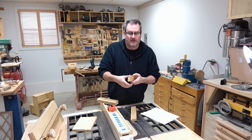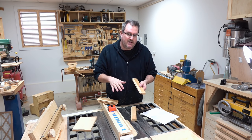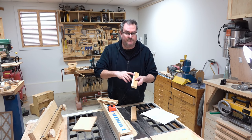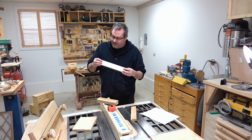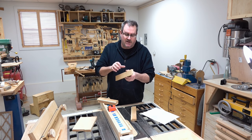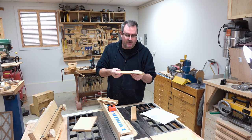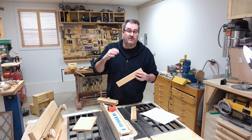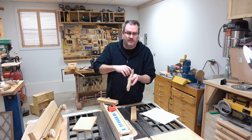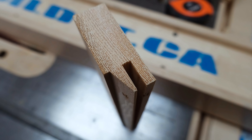As far as the profiling goes, these pieces are done — they just need to be sanded a little bit to make them smoother, although if your saw is set up right with very little runout and a sharp blade, you won't have much to sand. I should mention I couldn't get the quarter-inch space in the middle that I wanted. I started with three-quarter-inch stock but had to plane it down, ending up with pieces around eleven-sixteenths of an inch. To compromise, I got three-sixteenths of an inch on the bottom and three-sixteenths of an inch space for the panel.